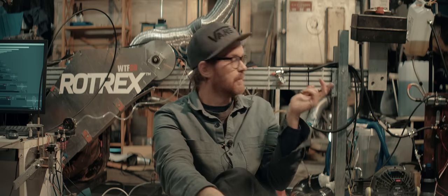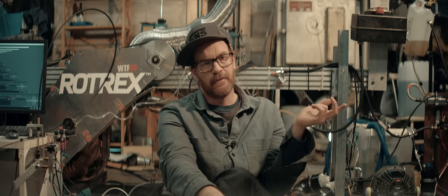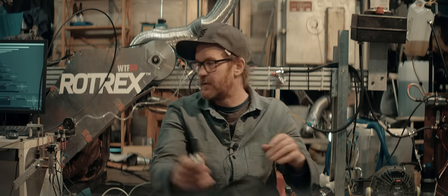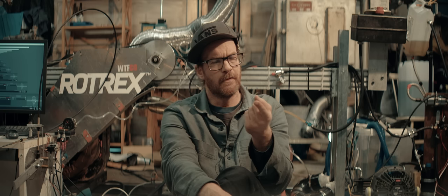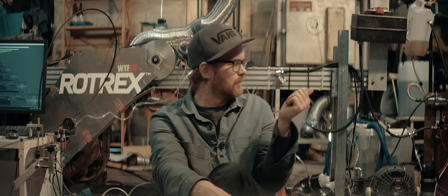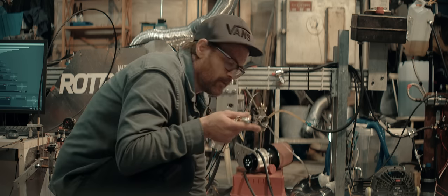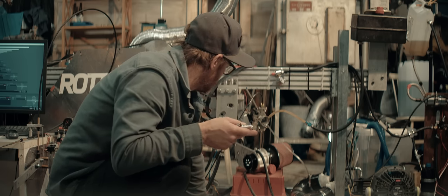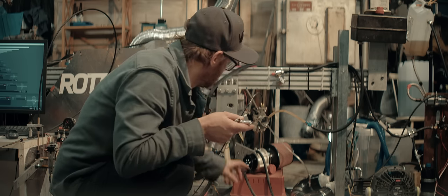The problems we're having with getting it into the power band isn't really an issue if it were mounted in a bike with a clutch, because then it wouldn't have to spin up the whole assembly here. An issue we will need to address is how it started cutting out when we got into the power band. Could be ignition trouble, could also be loss of compression. I experienced that issue when I went over to the United States to run at Bonneville.